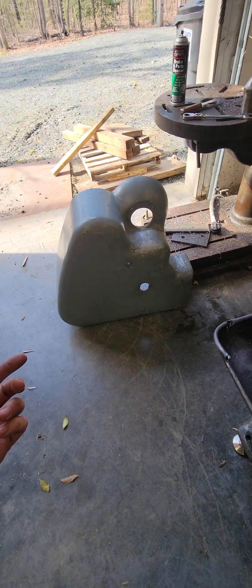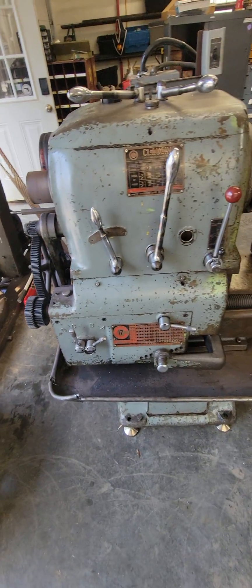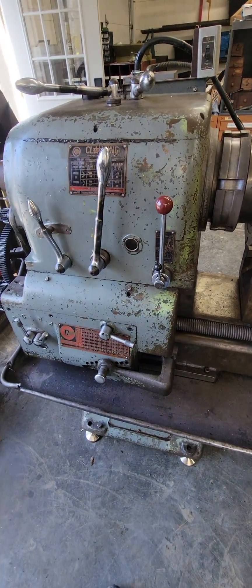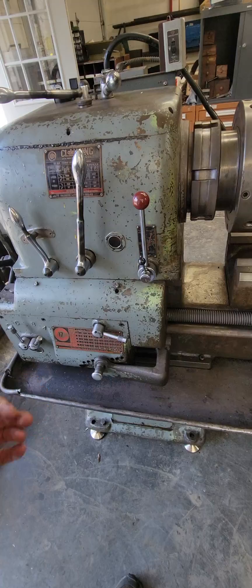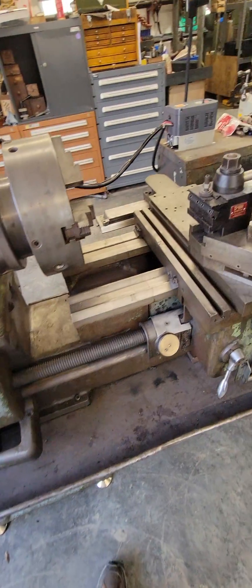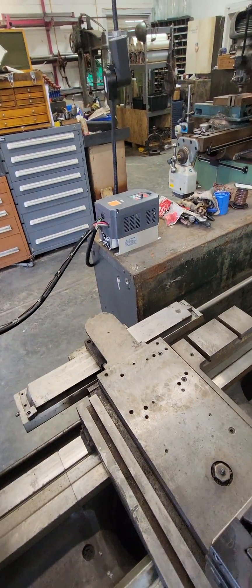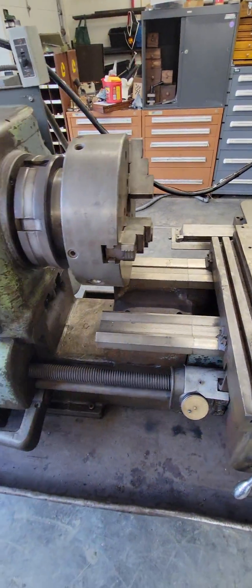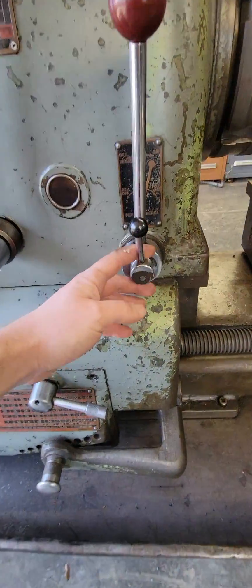The rear cover is off at the moment; I've been working on getting it wired up. I don't have three phase here, but it's a three phase eight horsepower slash four horsepower high-speed/low-speed motor, and I've wired it up on a 10 horsepower VFD so I can have a little extra oomph.